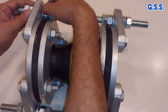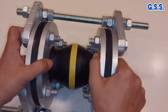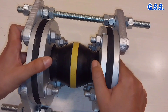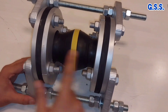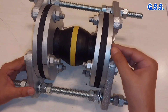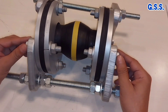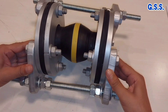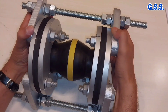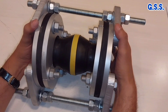This is 1 mm gap, so that when the bellow will tend to expand, pressure thrust will not go to the piping system. In this configuration, the stretcher plate is always bolted with the outside metallic flange. So the stretcher plate is rigid and there will not be any effect on the stretcher plate when we tighten or loosen the bolt.